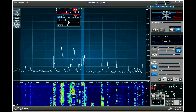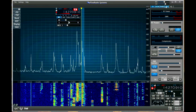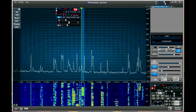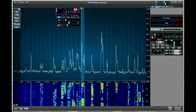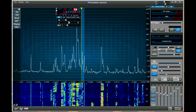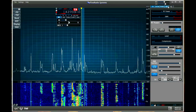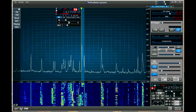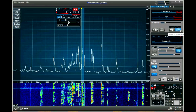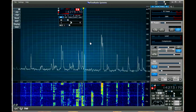On this right side are a whole bunch of control panels or panes, and you can select which ones are going to display by selecting these buttons at the top. Unless you have a really huge screen, you can't see them all at once — you can see four out of five, and you can turn them off and they slide around. I find that the equalizer setup for transmit and receive you generally set once and let go, so I don't need that much. What I do need is the first four: RF power output, SWR. Here are our RF power output slider controls to control your output power. Tune, MOX, ATU, and Bypass — we're used to these. You want to kick it into tune, PTT with the MOX. Let's move the slice over to a quiet part of the band and I'll show you the speed at which the antenna tuner works.